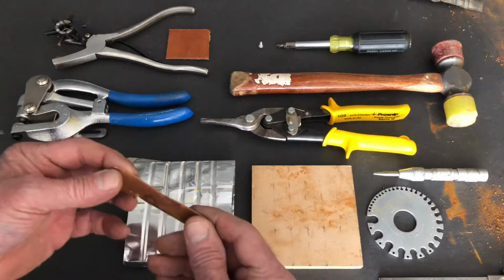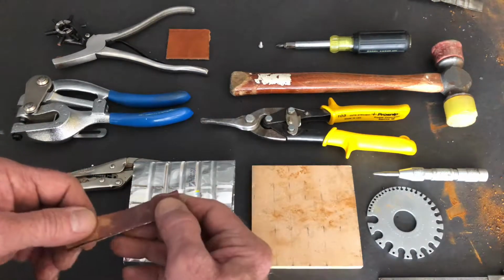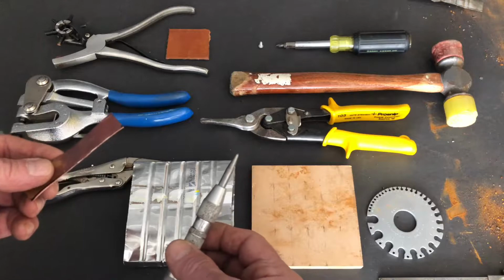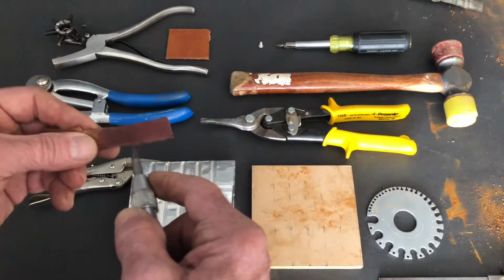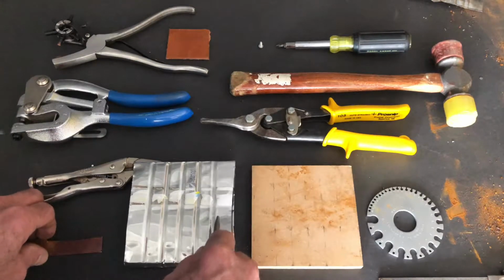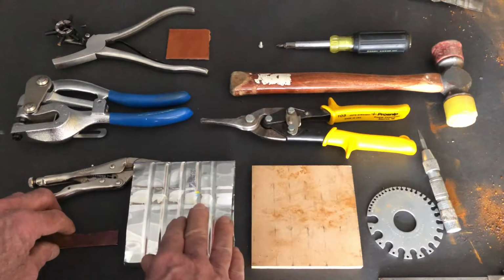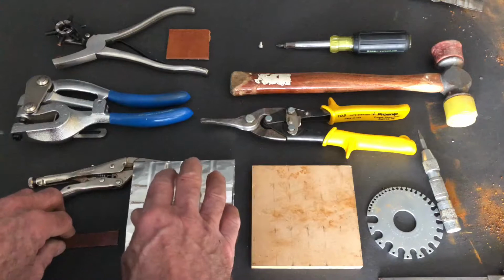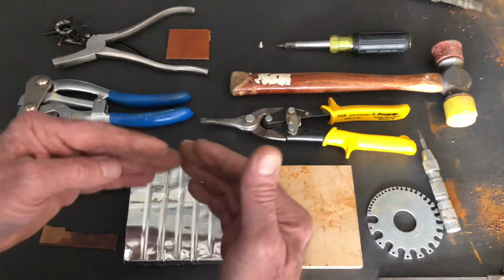Anything under 16 gauge, that benchmark or standard that we talked about, is going to be so easy to bend, or will deform so readily, that center punching is not a possibility, because the force of the center punch, even a spring-loaded one like this, would tend to deform or bend those thinner gauges of sheet metal. We also know that the force we had to use for self-drilling and self-threading fasteners is too much to keep that material from deforming or bending out of the way.